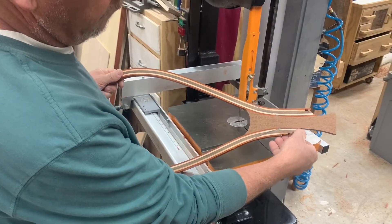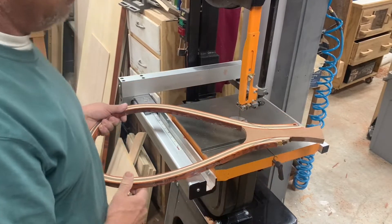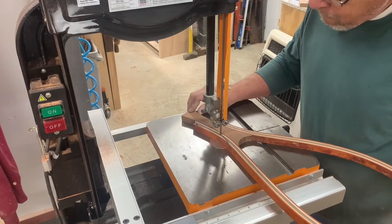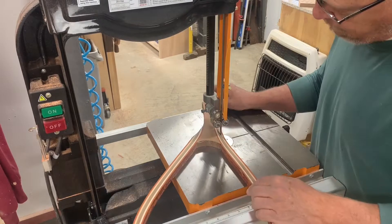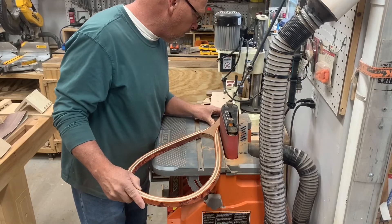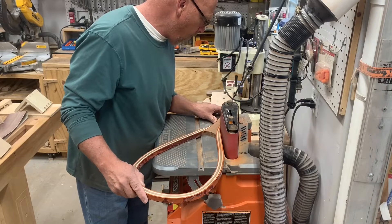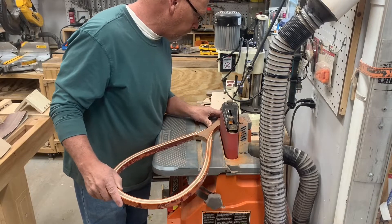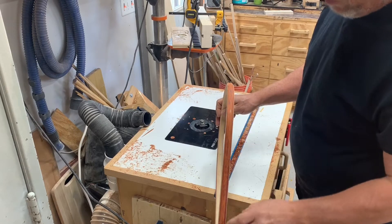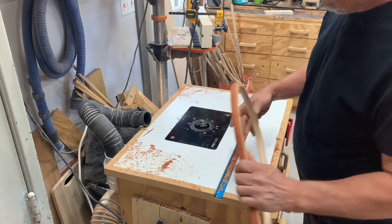Next, we're going to cut right at the handle and cut this material on both sides. Then we're going to cut the center slot where we thread in the dacron line. I've marked the center line and I'm going to adjust my router bit to center that.